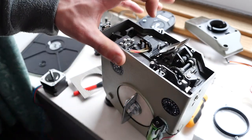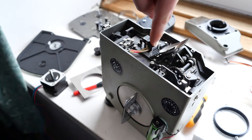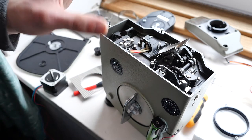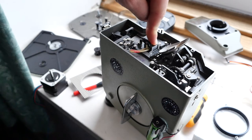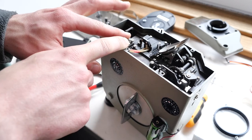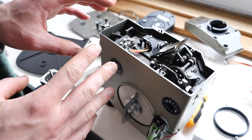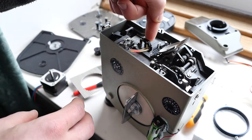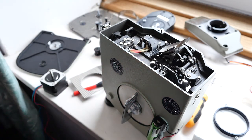Actually, the ground glass is physically fixed in position, so playing about with those screws is not going to affect the focus to the ground glass. I reckon all that's for is controlling framing in the viewfinder, so if I was to start playing with those screws I could maybe fix the framing so that what the film sees is framed correctly with what the viewfinder sees.